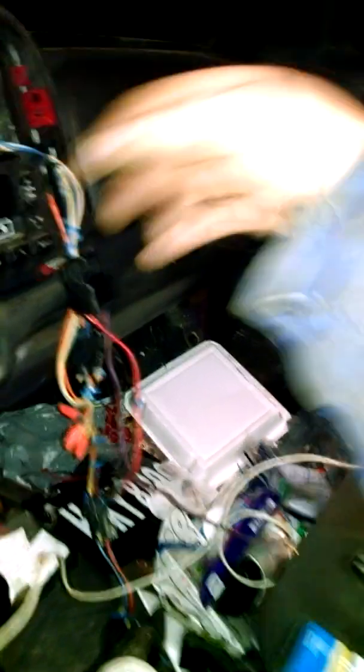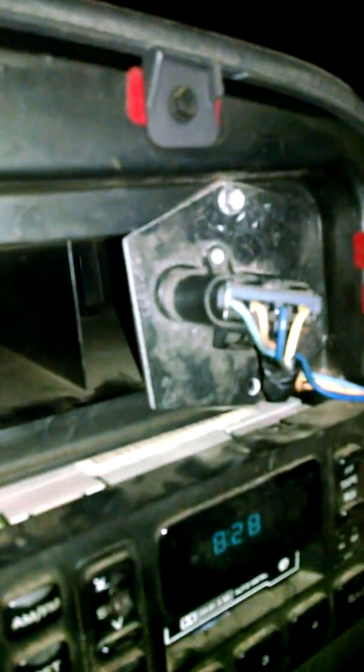If you have a spreader — even one with the smallest motor, that would be better — but I've got a somewhat heavy 12-volt motor for a spreader. If you don't have a speed controller, the next option is to go to the salvage yard or see what you have laying around in your shop. I had other parts from a donor truck, and I thought this blower resistor will work.